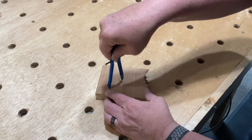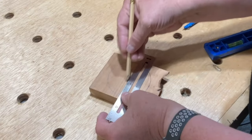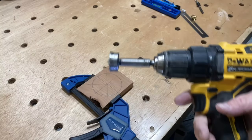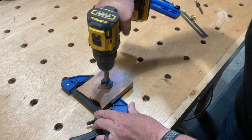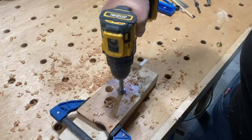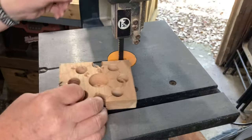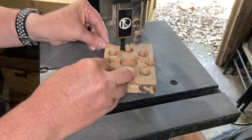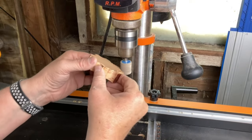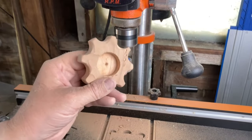Then it was time to move on to the snare mechanism. I rummaged up a piece of hardwood — cherry, I think. I drilled a 1 and a quarter inch hole halfway through the center, and then three-eighths inch holes around the perimeter. Then I cut it out on the bandsaw to create a star knob. I could have just bought one, but I thought making one myself would be a lot of fun. I used some flat sander bits in my drill press to smooth out the knob. I'll make sure to leave a link for them in the description below.